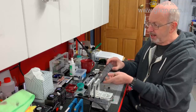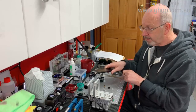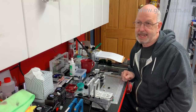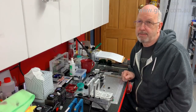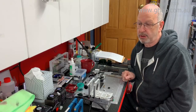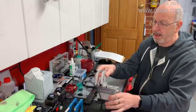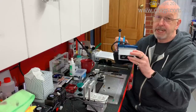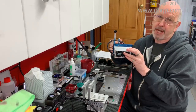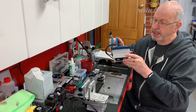This is a piece of aluminium showing all the tests — you can see it's got all sorts of engraving and lines. To cut a long story short, I was able to get a laser spot consistently around point zero six millimeters, almost a perfect square and not rectangular. I've got two laser heads — a ten watt and an eight watt — both based on the Endurance modules, but I've stripped them out and made my own bases and heatsink arrangements; they are fundamentally the Endurance laser system.